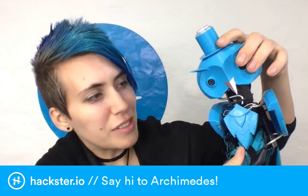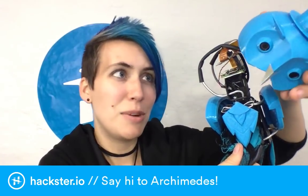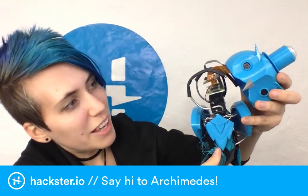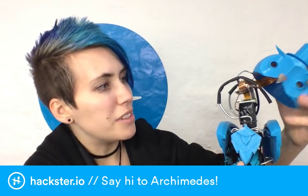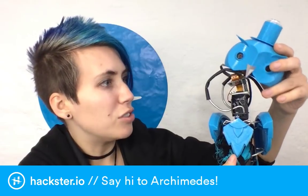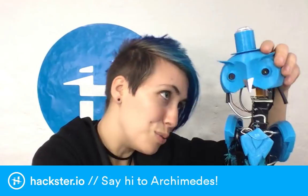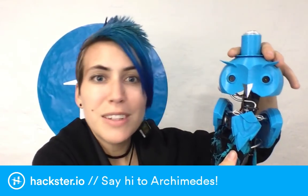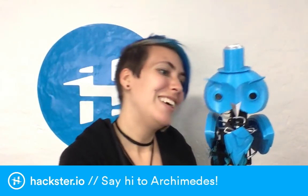So before I put this on, I want to show you inside the head, because yes, it is an AIY Vision Kit, and the head is propped up, everything's glued inside to the eyes and stuff. The head is propped up by these pieces of armature wire that are attached to the servos, and they're covered with heat shrink tubing just so that they're insulated. And then there's also a little indicator LED that tells you when he is on and ready to start judging people. Boop, boop, boop. Then he just goes on like that. And he looks super cute, if I do say so myself.